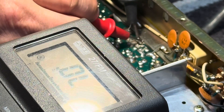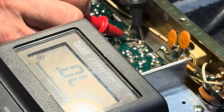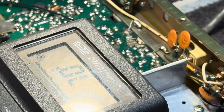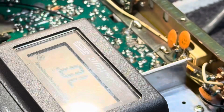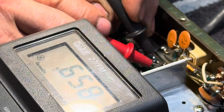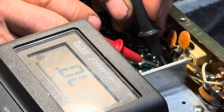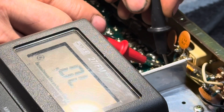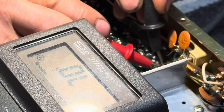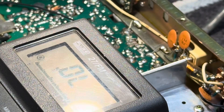Nothing there on that side either. I touch the two together — nothing. So this thing is completely open. That's not good. I've got another final transistor and one side does work, but the other side is open. A reading of 0.658 is kind of normal for diodes and a transistor as it goes through — it's its rectification, its ability to polarize or keep voltage from going the wrong way. But we have an open circuit on the other side and we should have a reading, so I know that's bad.